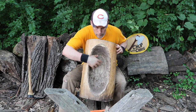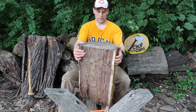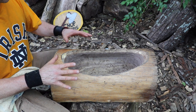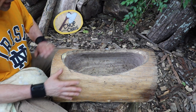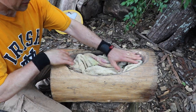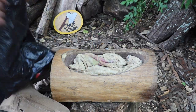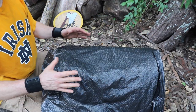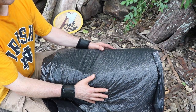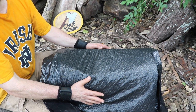I've done the initial rough-in to the inside of the bowl and I'm going to start working on the outside. Just a quick note: this thing is always drying and always wants to crack. So I've anchor-sealed the entire outside and the ends. When I'm not working on it, I keep a moist towel on the inside to prevent cracking, especially on the end grain. Then I keep a plastic garbage bag over it — that just slows the drying process. You have to be careful that you don't leave it like this too long, because the moisture will come out and you get mold. So I'm working on this basically every day or every other day if I can.